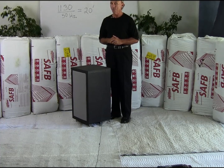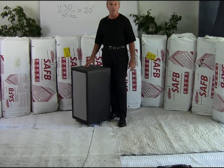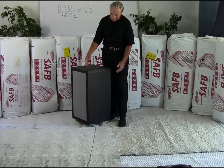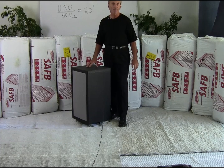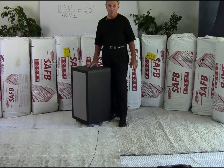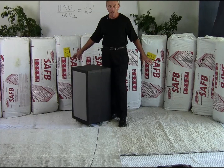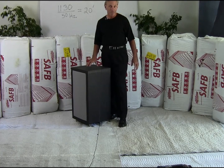But a diaphragmatic absorber will do it in a much smaller area. This is a miniature version of our ACDA12, which is our lower frequency diaphragmatic absorber with activated carbon technology. You can see it's about 15 inches deep with a 2 inch foam face. From our test results, you can see that we absorb 100% of 50 cycles in this small amount of real estate — all of that 20 feet of building insulation, we do in about 15 inches.